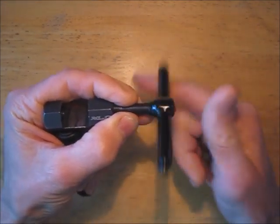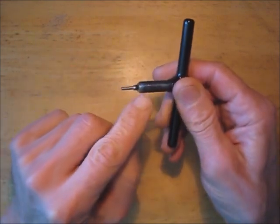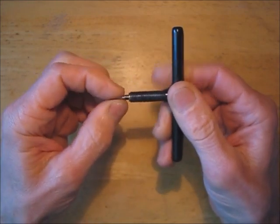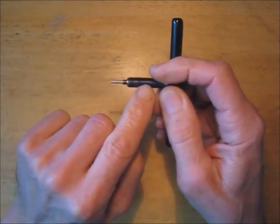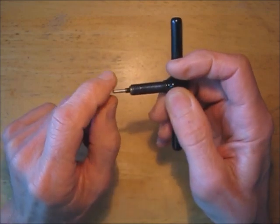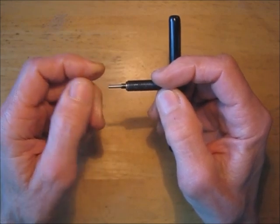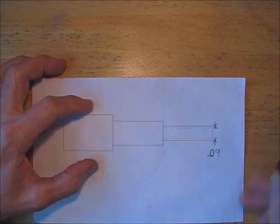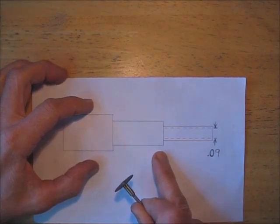The diameter of the pin remover was too large, so I had to grind it down. The pin remover is held in the pressure bolt with a brass retainer. You can grab the pin remover in a vise and just pull on the pressure bolt and it'll come apart. Be careful because there's a ball bearing inside, and be careful not to torque it back and forth — you may break it because it's probably brittle, hardened steel. I had to chuck it in a drill chuck and grind it with a Dremel tool down to 90 thousandths, up to the first step.